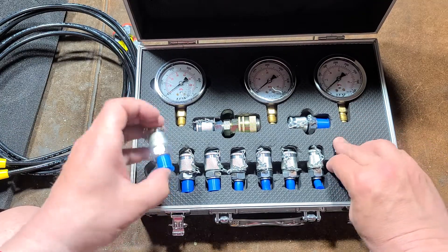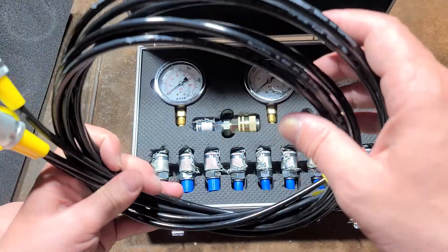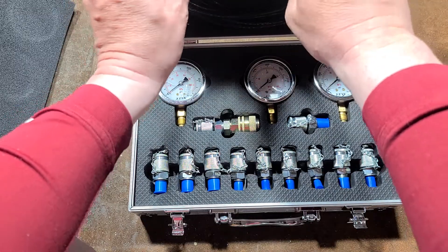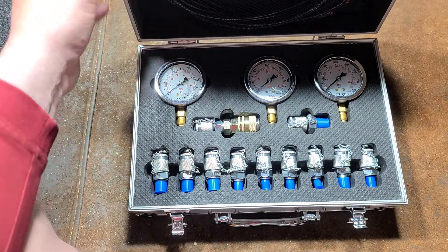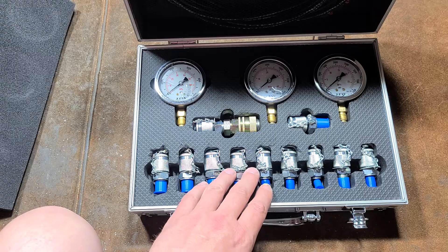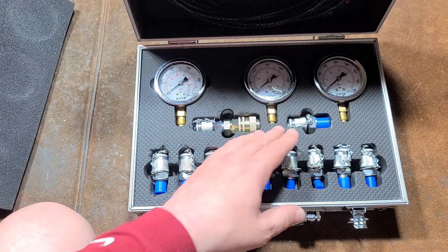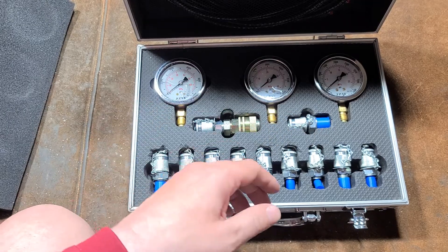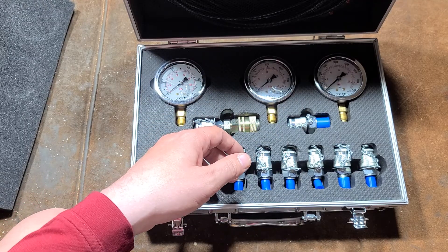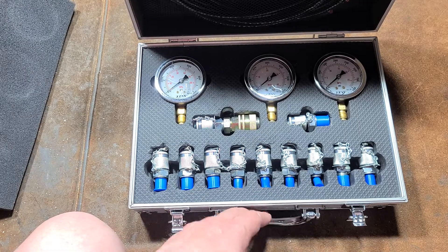As far as I can tell from my research, this will cover a lot of the hydraulic test ports people may run into. And for $70, it's actually not a bad price considering it has glycerin-filled gauges and is using German test hose, which I was happy to see. They do have a larger kit with a bunch of T fittings to do inline measurements. If a hydraulic cylinder isn't moving as fast or with as much force as expected, you'd disconnect the cylinder and plug this in to see if the pump is pushing enough pressure. With a T fitting you could do it inline and watch it live — but that's the whole purpose of these.